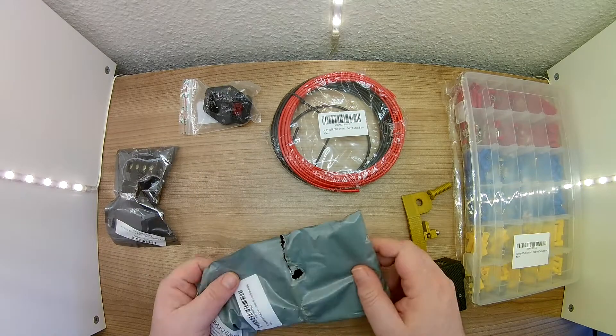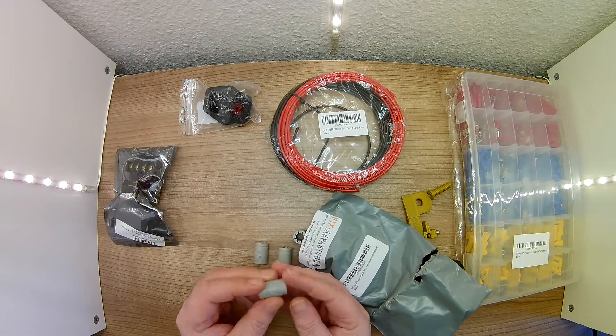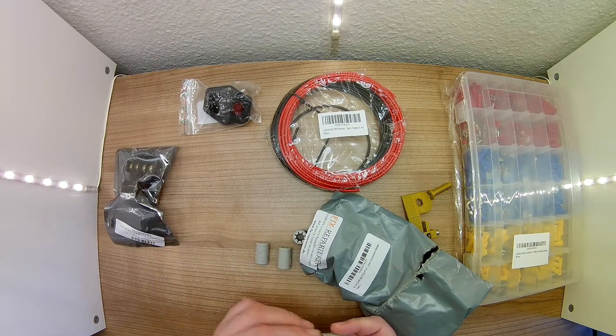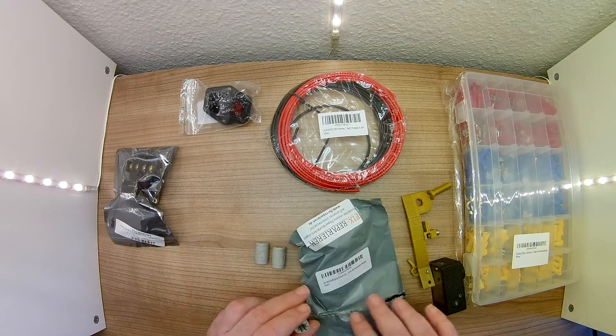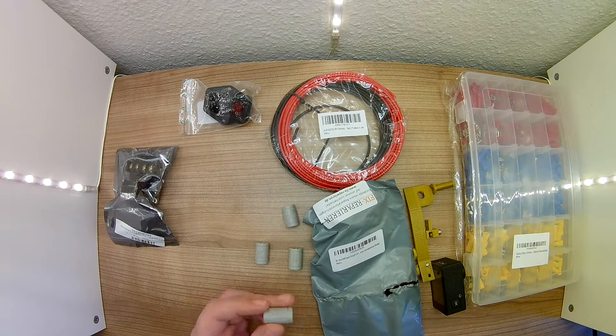Then I have these slides, the linear bearings for the heating bed and the print head. I ordered these new bearings for the poles — I ordered 8 pieces, although only 7 are needed. Then everything moves a lot better. They should run much softer and work more quietly, so the print gets better. I would like to exchange them.